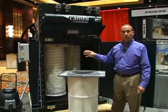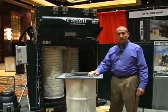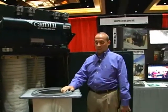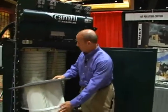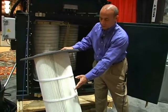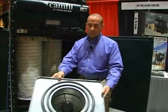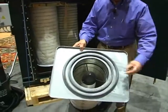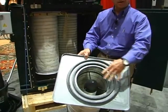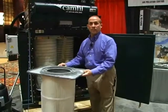It's a very compact, very robust setup for end users to get lower pressure drop and longer cartridge life. Our pleating technology is very different — very wide pleats, very consistent in their construction. This again allows for lower pressure drop. As you can see, what we call our gold cone technology allows the cleaning compressed air to help distribute that air throughout the cartridge, keeping it cleaner for a longer period of time.